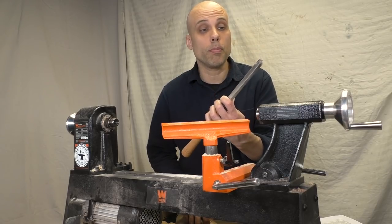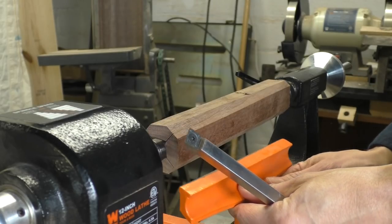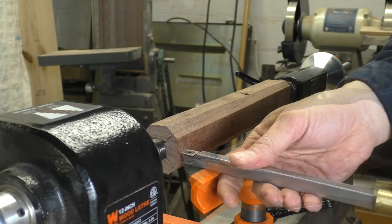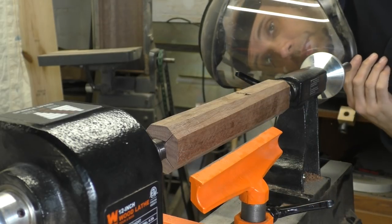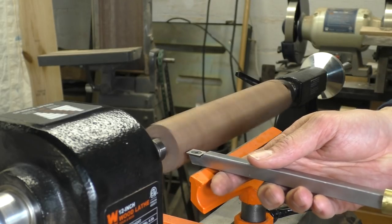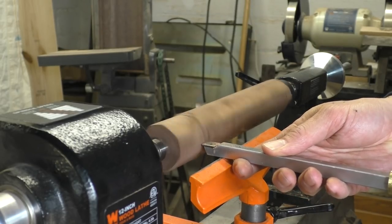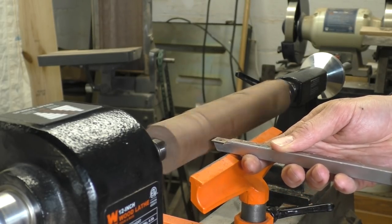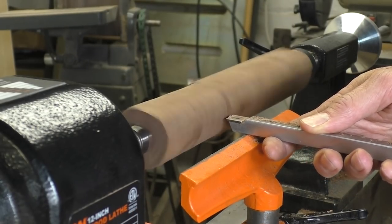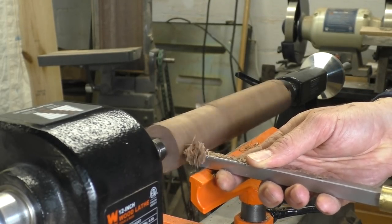For this project we are going with carbide tools, and for these it's really important to set the height of your tool rest. Since carbide tools work using a scraping action they need to be right around the center line of your work. I've got my face shield on and I'm going to stand away from the work while I turn the lathe on. Nothing went flying and the piece is turning smoothly. I can put my tool on the rest and gently advance into the work — I get a cut right away. I'm just taking this rough piece and making it into a cylinder, sliding back and forth for light cuts or taking little bites for faster results, then sliding for a smooth finish.